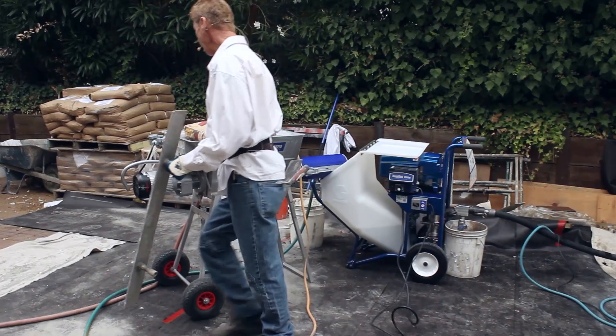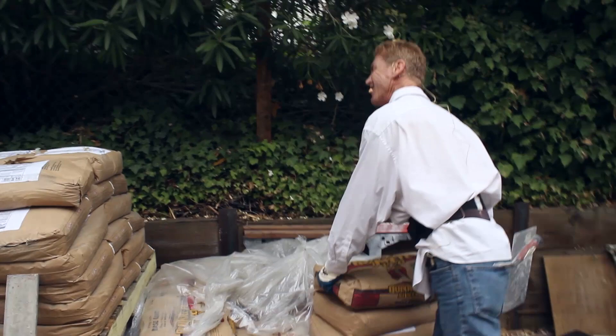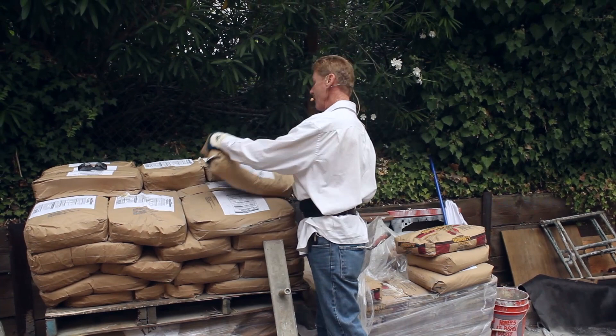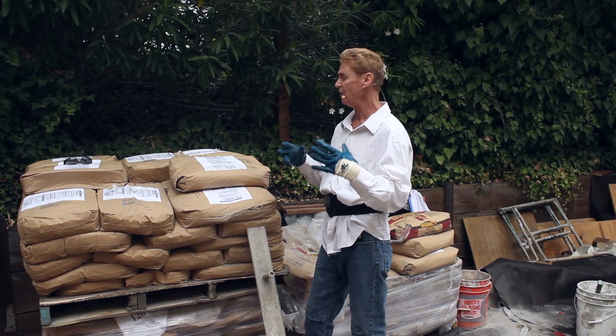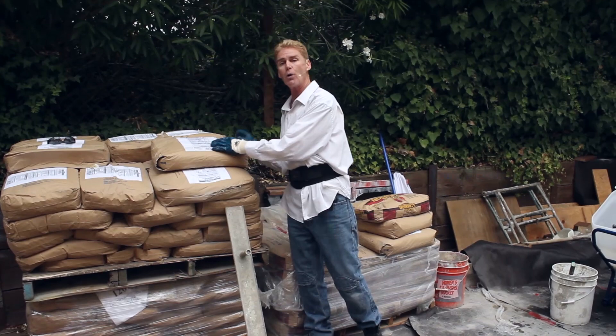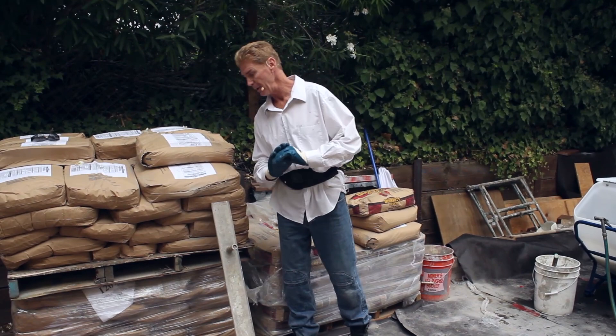These bags here are Quikrete. These are 50-pound bags and these are 80-pound. Eighty-pound bags are kind of heavy, and I'm no spring chicken. But these 50-pound bags — why are they so much lighter? Polystyrene. Basically styrofoam coated with a cementitious product. You'll get the same volume with this 50-pound bag as you will with this 80-pound bag. We can use the machine to pump this, or we can put it on by hand. The beauty is it's lightweight — it's like putting on whipping cream. If you're used to sand and cement, this product makes it so much easier, especially when you're spreading it.